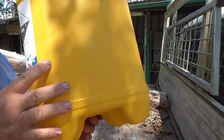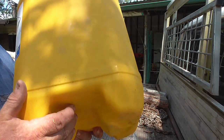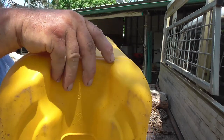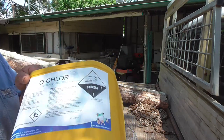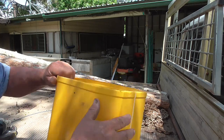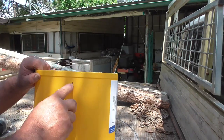On the bottom of these drums you can see they're made so they can stack on top of each other, and that's where the handle fits when stacked. The trouble is how you orient the handle relative to that slot matters — if you put it the wrong way, when you tip it your hand wants to slip off. Whereas if the handle is oriented correctly, you've got something good to grab hold of when you tip it up. So with a marker, mark a spot on either side directly down from the bottom piece, and that will make the orientation for your handle correct.